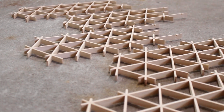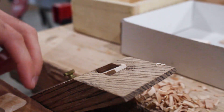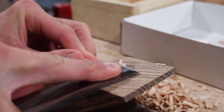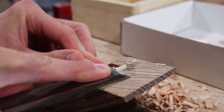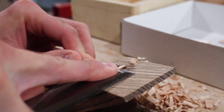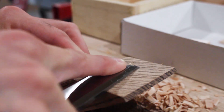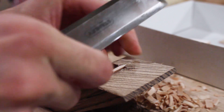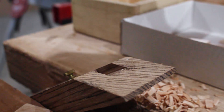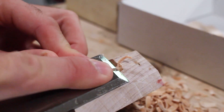With the grids done, I can move on to the infill pattern. For this type of pattern I need to cut a 30 degree point on one end and a 60 degree point on the other end of these pieces, and I'm doing that with the help of my Kumiko jigs, which gave really accurate and clean results. If you're interested in trying Kumiko, I make Kumiko kits, which are a great way to get started and learn the fundamentals of Kumiko, and I also teach online classes. Both of those are linked in the description.